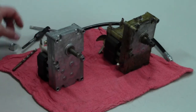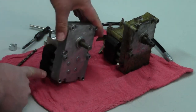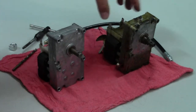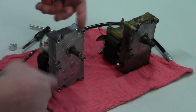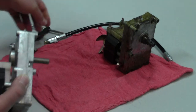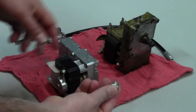What I'm also going to do is, when I take this apart to drill the hole, I'll seal it back up — because I don't want to hit any of the gears or put any metal shavings in there. Sealing it will also prevent some of the grease from leaking out and making as much of a mess as it did this time. So I'm going to start by disassembling this so I can drill and tap for my fitting.